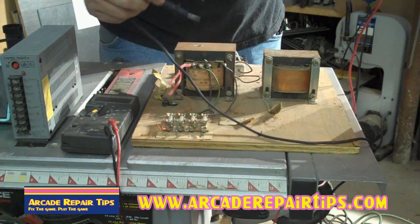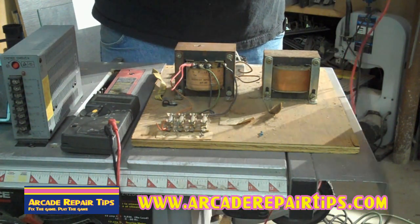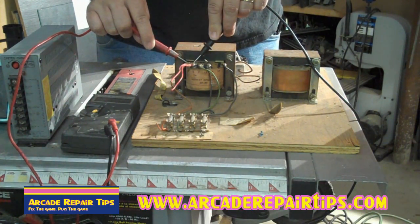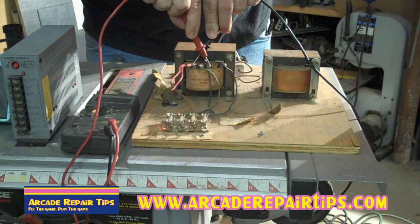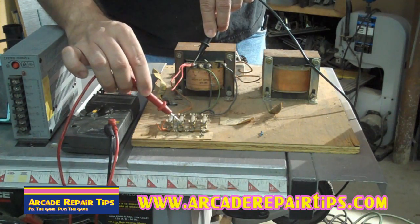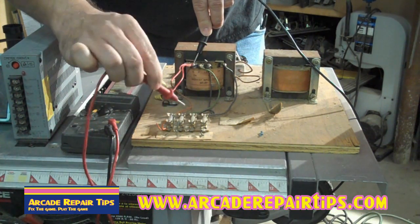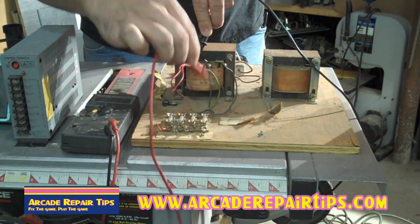You might notice there's quite a few wires around here. Mine are labeled, and sometimes you'll have labels and sometimes you won't — sometimes you're just going to have to find between the wires. But this one right here is zero volts, this red wire is seven volts — 7.15 volts right now. We have seven volts here and I think this is 12 — 11.74 here. We can hold one lead here and go across this fuse to the other side and we're reading seven volts. That tells me the fuse is good because power is going all the way through it. So the fuses are good and we have power going all through here.